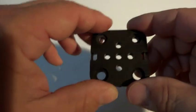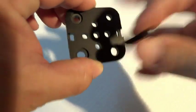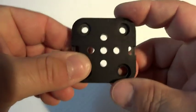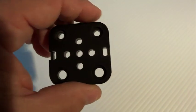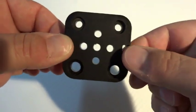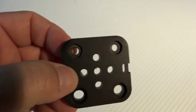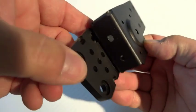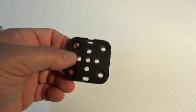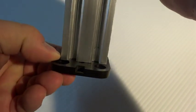That's why this hole area is open bigger — to allow the screw to move inside the hole as it's being tightened. We'll have two holes with eccentric bushings and two with standard spacers. The holes on the side are for belt — your quarter inch or six millimeter belt goes through here and loops back onto itself. The holes here are a mounting pattern at 20 millimeter spacings for mounting end caps and other accessories.